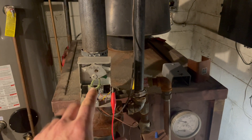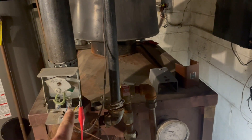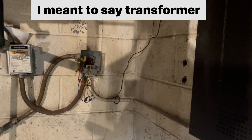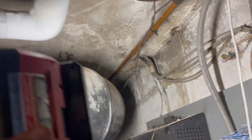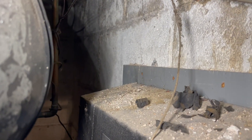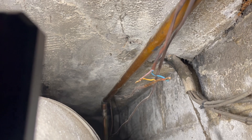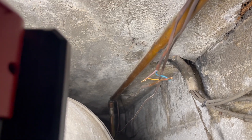We just started with voltage. I should have 24 volts somewhere — did not have it there. Here's the thermostat back there, but I had my 24 volts there. So I traced that down and found out I was losing it at this splice up here. Had this super old crusty, ancient electrical tape, some kind of cloth tape, and that's how the splice was done. I've got that kind of reconnected temporarily — I need to put some wire nuts on it.